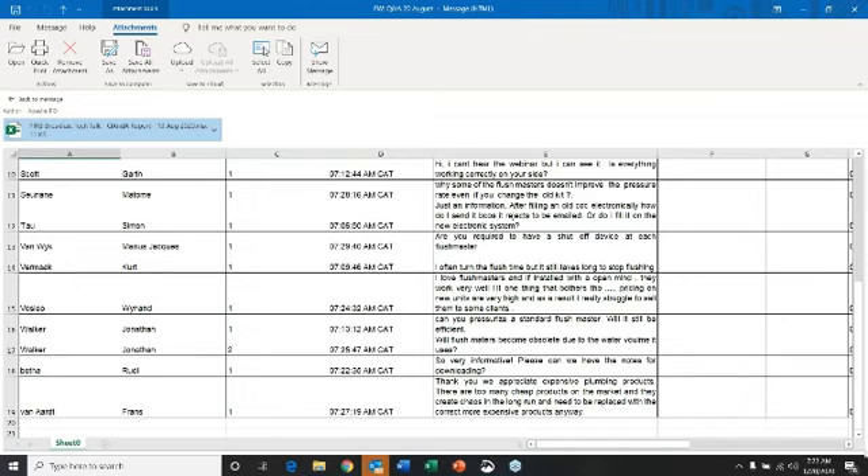It's also important at tendering stage — if it's not properly specified, you go and price to do the thing properly and then compete with a guy who sticks in half-inch polycop pipe and beats your price by millions of rand, but when he's finished the job it doesn't work. You want everyone tendering on a level playing field — the specification needs to say this thing needs big pipes or tanks or whatever it is, so that whoever quotes knows what they're getting into. We can really help with pipe sizing and layouts when you're starting a job like that.